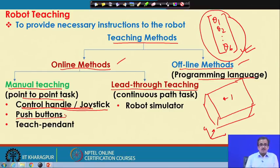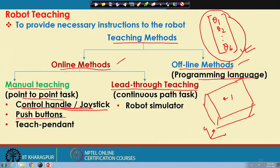Then comes the push buttons. On the body of the director or controller, there will be a few push buttons and with the help of these push buttons, we can control the movement of the tip of the manipulator either in the Cartesian coordinate system — like x, y, and z — or in joint space, like in terms of theta 1, theta 2 up to theta 6. We can increase and decrease the numerical values for the x, y, and z movements. Through some trial and error, the moment it reaches this particular point, we store all such theta values with the help of optical encoders. This is how to use the push button. Next, I am going to discuss how to use a teach pendant for the manual teaching.